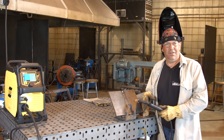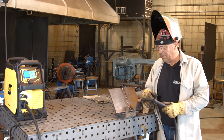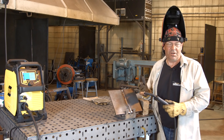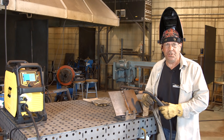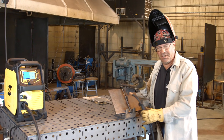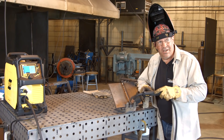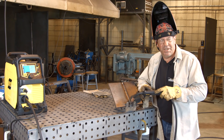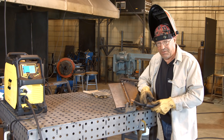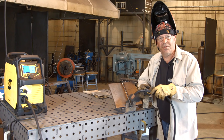I ran the root on this downhill. I've already buffed the slag out of the inside with a flat wire wheel. I want to put a fill pass and a cap, except now I'm going uphill. I never want to weld downhill in a groove — there's too much chance of lack of fusion. When we did the root, my wire was pointing uphill about 30 degrees and I stayed on the leading edge to get fusion and control the backside. Now I want to point my wire straight in or slightly downhill, believe it or not.